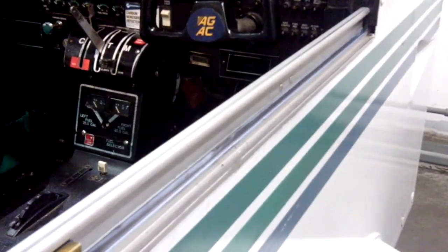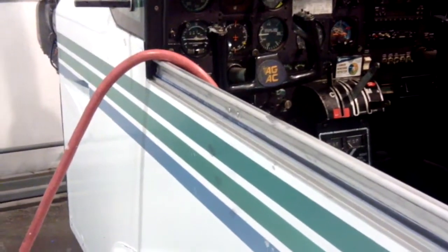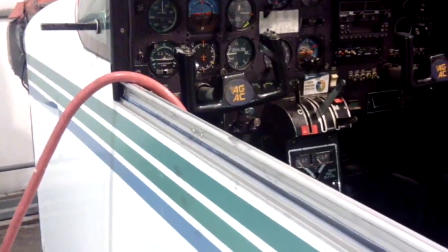Here's your canopy track — you won't get all the gray out, but it will get back to almost white, which is what you want. You'll never get it back all the way. This is what a clean canopy rail looks like. You can see a little dark gray area up there in the front, but for the most part it's all nice and clean. The rails are clean, the buttons are in, you can hear the boom-boom. So we're ready to put the canopy back on, and we'll wait until we have a second person — canopies do not like to be dented. Thanks for watching our Grumman Pilots YouTube channel, which directly supports the Grumman Pilots Association, your GPA. Have a fun day flying.